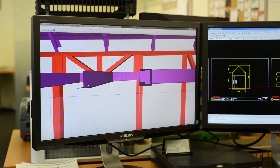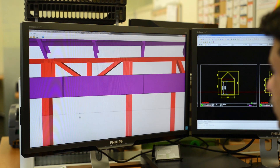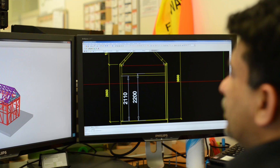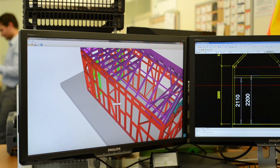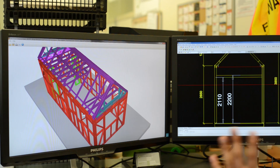We don't want a lattice joist or web joist 300mm deep, so we are limited with the roof panel and floor panel. To strengthen it, I make a back-to-back configuration at 400mm centers — and it should be structurally sound. The second thing is because once we transport, we have to have a very stable structure. For that reason, we normally place K braces — these bracing elements restrain the whole structure from movement. Also, when we have cladding on top, that also acts as a bracing element to strengthen and rigidify the whole structure.